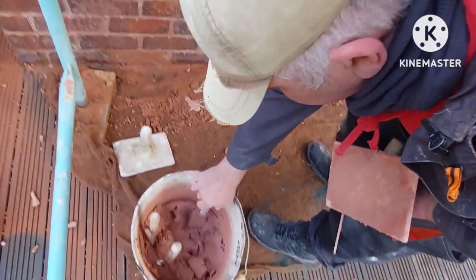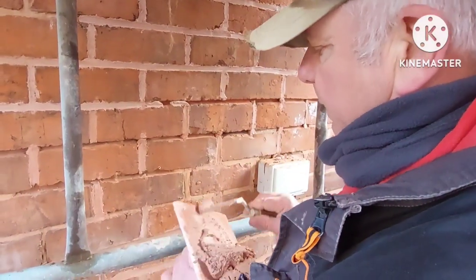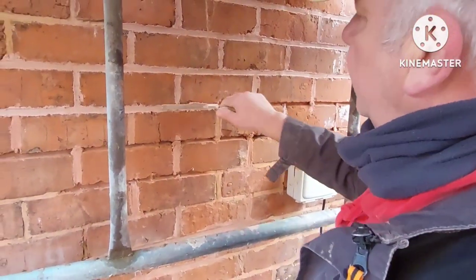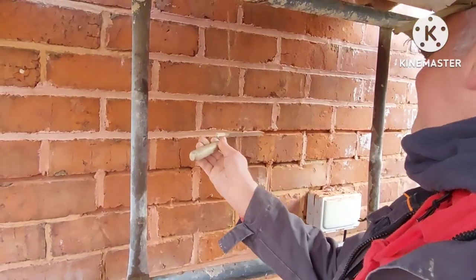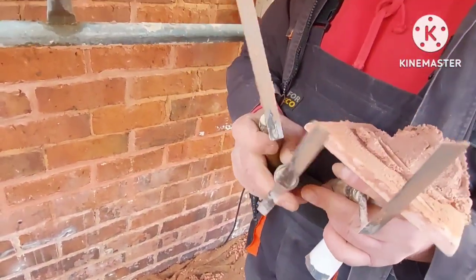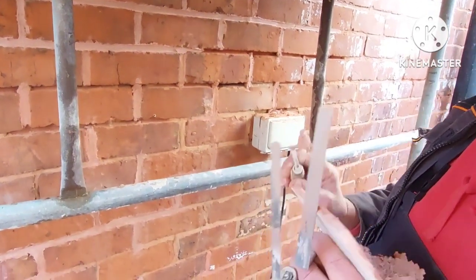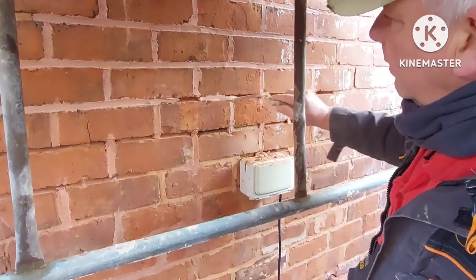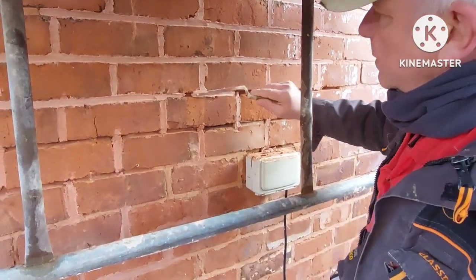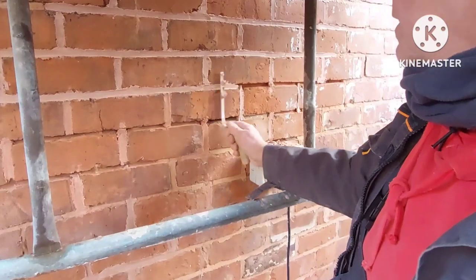You can see the principle — pushing it in, pushing it back. You don't really want to be getting it all over the bricks, do you Miles? No — Miles has learned that one. Three different sizes of trowels, because not all your joints are the same thickness — they all differ. Whether it's your bedding joint or your perps, you'll find they're all different thicknesses. That's just the nature of how bricks are laid — the shape of the bricks, wear on the bricks, and sometimes somebody's come along with an angle grinder and taken a load of brick off during previous pointing.